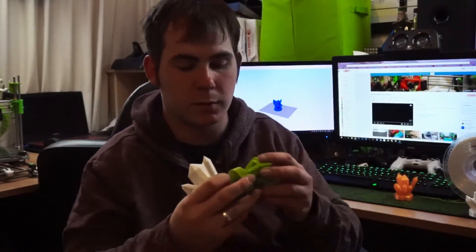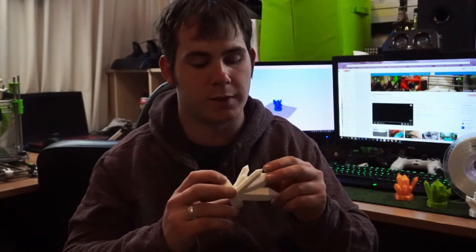This one also had some under-extrusion and stringing issues, but absolutely no holes in the top of the part. The green was similar, with only very small pinholes — nothing like the Elixir parts. I did print a couple more that bridged really well after adding a bit more extrusion multiplier to this filament, due to some weird artifacting going on with it.